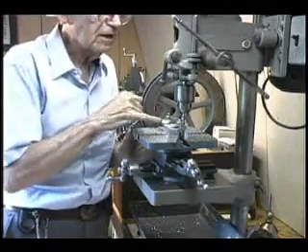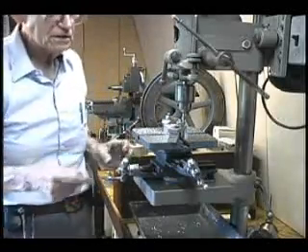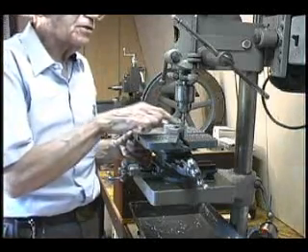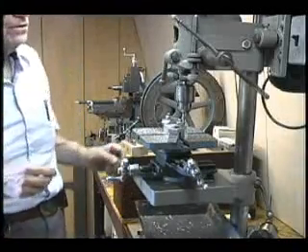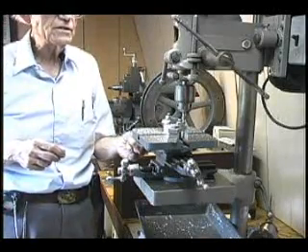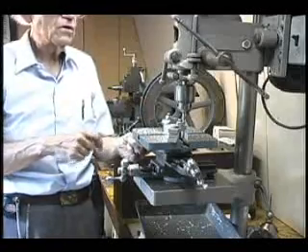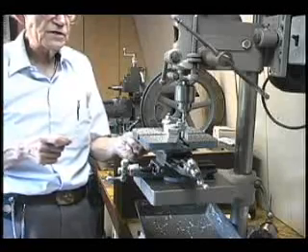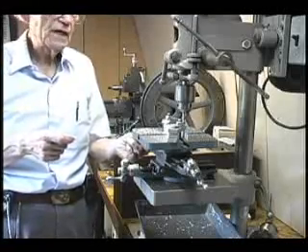You can see the groove is wide. You can't feel the edge where it came across because one side is cut just as nicely as the other. It would be possible to deepen that groove any amount I wanted, or to machine off the entire top surface to produce a uniform flat surface. Almost any of the cuts you do on a standard milling machine can be done on the drill press if you do them carefully. It's possible to use a fly cutter in the chuck to produce a broader area, or to use smaller end mills. The end mills you use have to be single-ended because the chuck doesn't have the depth for holding a double-ended mill. But by working carefully, you can do some acceptable milling work on the drill press.